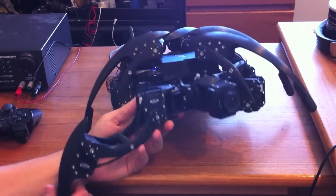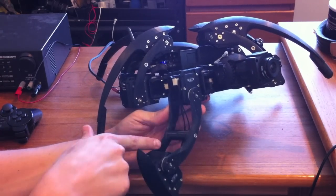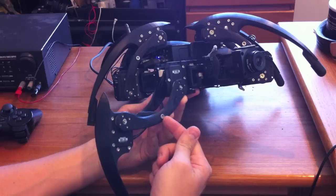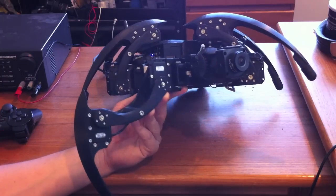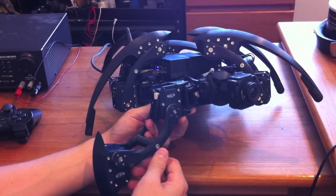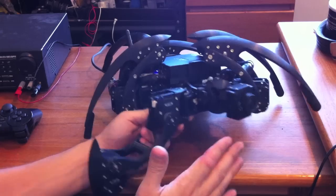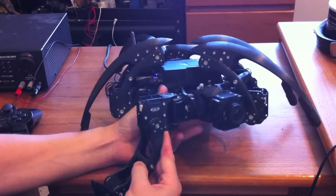The next update is the femur here. The femur is also a split design, and each side is identical. They sort of lock into place, and then they're held in with this bolt. The bolt probably doesn't do too much, but it gives it a better look. Again, designed to be made out of aluminum. Before, it would be impossible to assemble if it was all one piece. Now you attach one side to the motors and the other side slides right on, which makes it much easier to assemble.